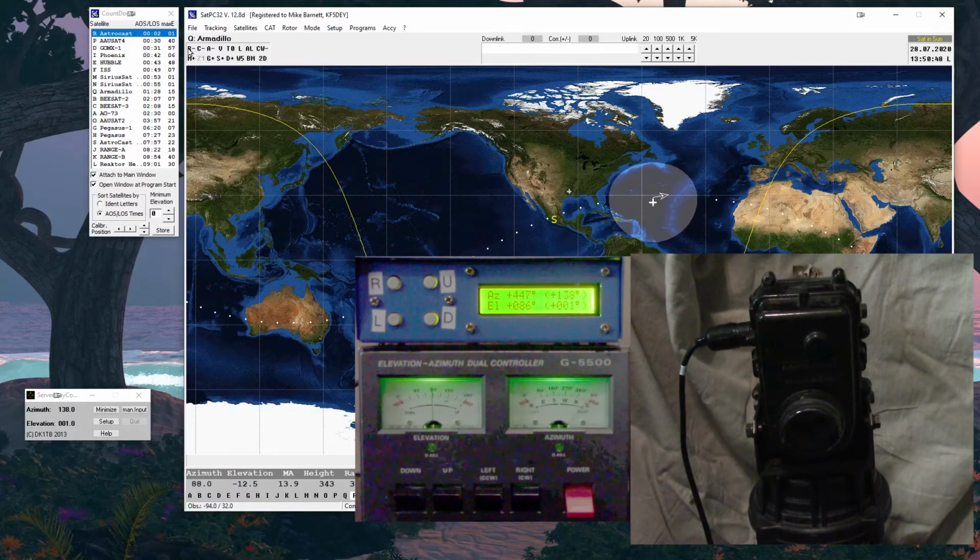I'm including the instructions when we store it away, in case for one reason it gets stupid and you have to recalibrate. But it's supposed to maintain its calibration in EEPROM and never deal with it again. And it's always calibrated for a Yaesu system. It understands that setup. So I think now you can kind of see why we need to know where north is, and we need to know where the limits are for the cable control, as well as to make sure we got the antennas pointed the right way. So that would be the first part.